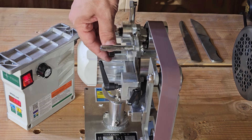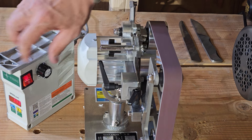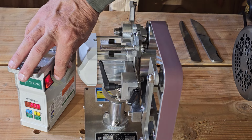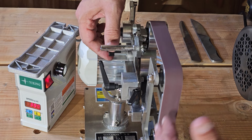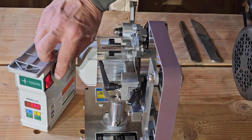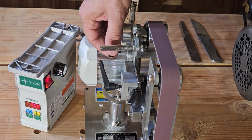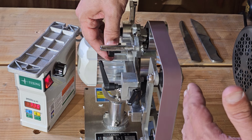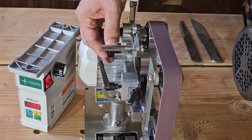This right here will adjust your belt — it's your guide. Turn this on very gently, as slow as it'll go. Get your belt lined up with all your wheels and then increase the speed a little bit. Make sure you're staying true and you can always adjust right here. I'm trying to walk it back over to where it needs to be — okay, that's about right there.